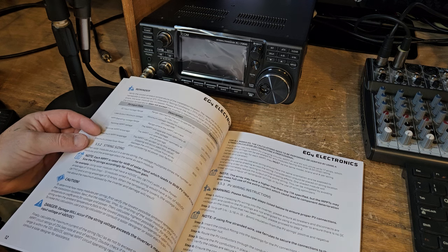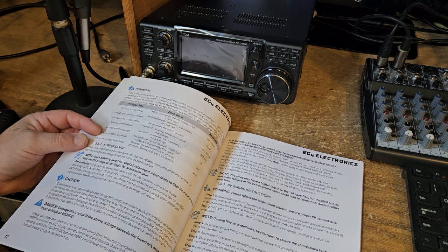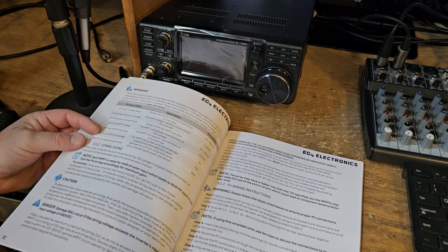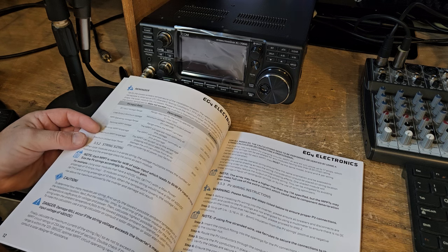But when I have 8 panels and 2 of them are in series to parallel, those two series panels are each about 5 amps, and then you got 8 altogether. So basically 5 times 4, you've already got 20 amps right there on that whole thing. So probably what I'll do is I'll put 8 panels on this thing and we'll see how it does.